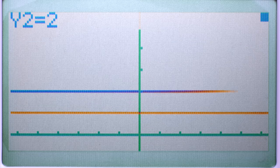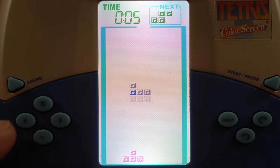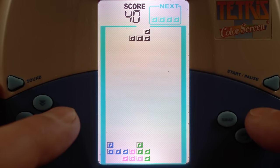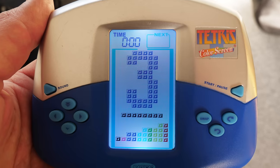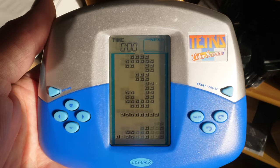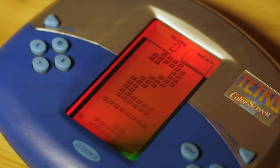This never became more than a gimmick. I wonder if its development hadn't stopped, you could very well be looking at a display without color subpixels right now. Speaking of color without subpixels, here's another approach in the form of a Tetris game. You may notice the flickering display, and that's because the backlight is not really white — it's instead changing from red to green to blue really fast. When holding it in the sun, the colors vanish because the backlight isn't bright enough. To give segments their color, they turn on or off in sync with the red, green and blue, dependent on the required color.